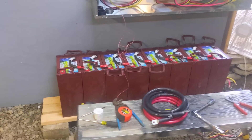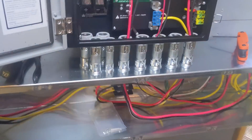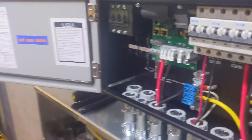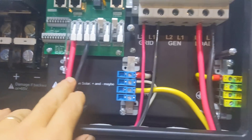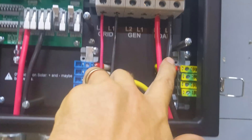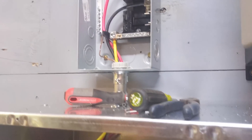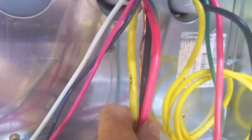The next step is we've series'd up the batteries for our 48-volt AGM battery bank and we're wiring up the 5K — I'm so used to saying 12K, but it looks the same. Solar from the array Abraham put on his roof has landed. We've got our grid bi-directional connection and our load connection. In the shed, we took the load to a power distribution block, splitting between the critical loads panel here in the shop to run lights, tools, and charge batteries, and then back to the critical loads panel at his house.